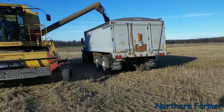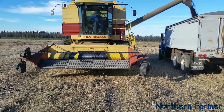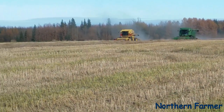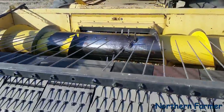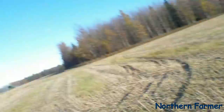I did some repairs on this combine and fixed that chain that broke — it runs the big cross auger intake. On Lori's combine, the other New Holland, it was one of those black plastic deals that go through the finger. I managed to get one from the John Deere combine that fit in there; I just had to trim it with a knife. So, John Deere parts on the New Holland combine.